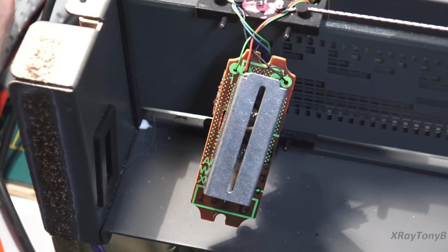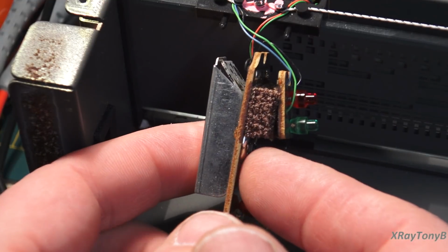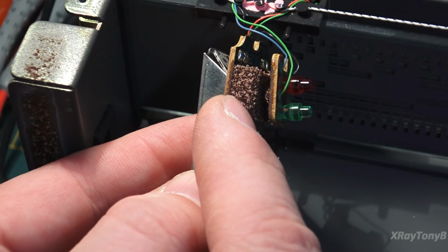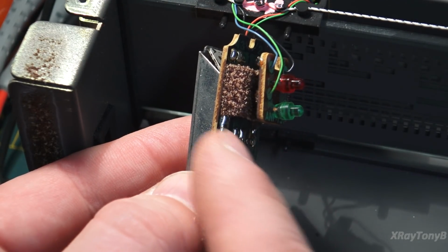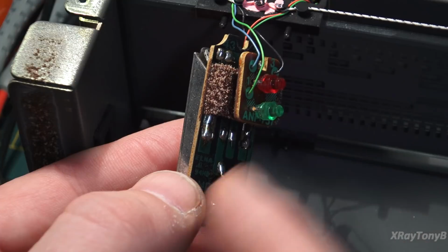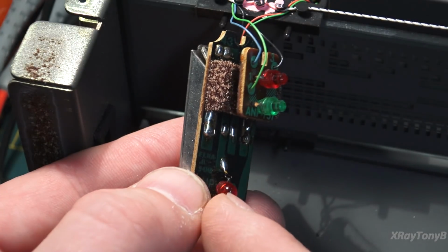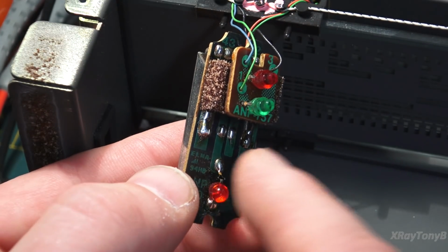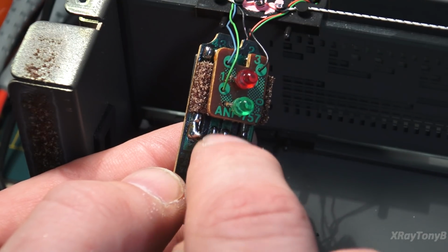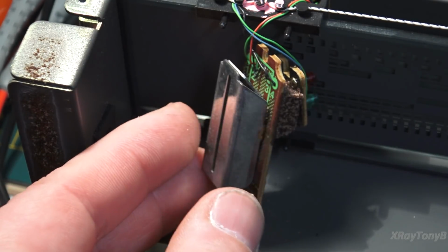And that's our problem. Now, I'm not going to move this very much, but I want to share this for the record in case any of you get one of these and ever get to work on one. There's a piece of foam in here that's become very deteriorated. It's coming apart. It's basically glued between here and here, and that's what holds the locked and stereo, the tune and lock lights in. So I'll have to come up with something for that. And that has to be removed anyway because the bulb shield is actually soldered onto the board, and the bulbs are soldered underneath. So all that's going to need cleaned off. And I'm going to do this all off camera, obviously.